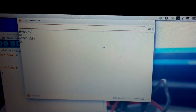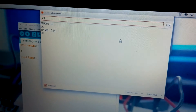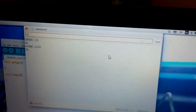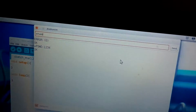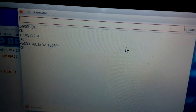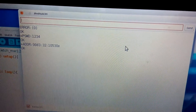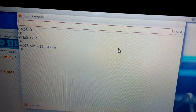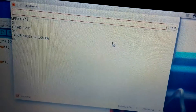Now you want to know the MAC address or the physical address of our system. So we key in AT+ADDR? and we send that one. It comes back with our MAC address, which is 98D3 and so on. So we've been able to know the password and also the MAC address of our device. We can locate it anywhere on our Bluetooth module.